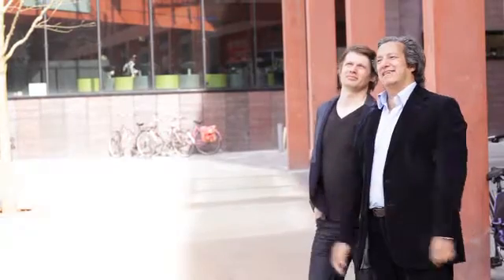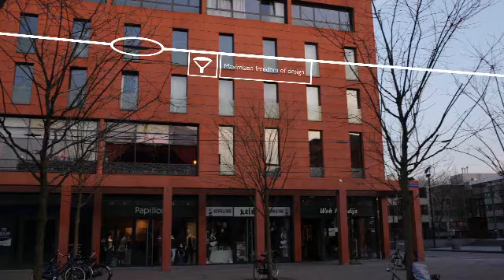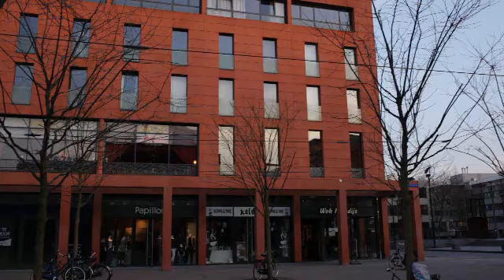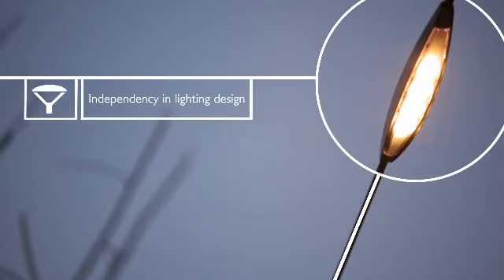Free Street is unlike any other suspended lighting solution in a city. It offers an enormous flexibility in terms of how it's installed in the street. Free Street is mounted in a parallel way along the street, and in that way electrically only needs to be sourced to the facade every 100 meters, compared to every 20 meters. So that creates a lot more independency in how you install the system in the street.